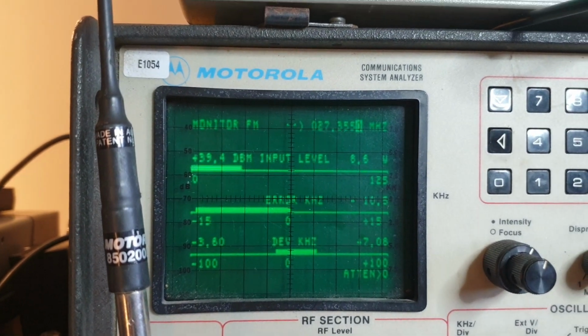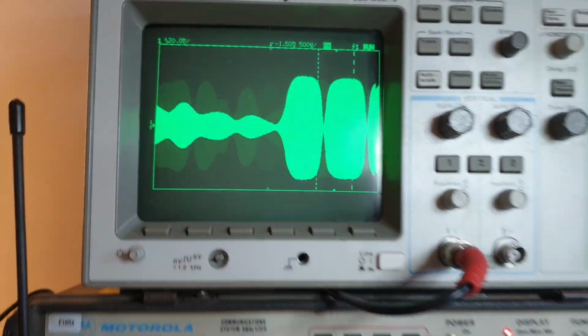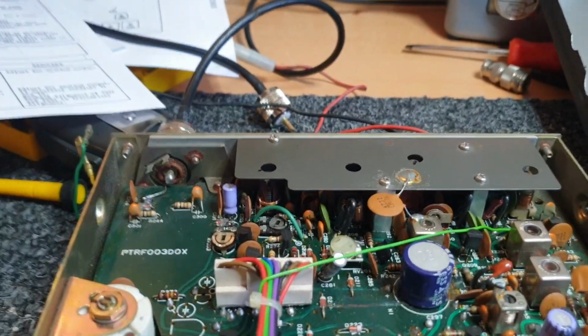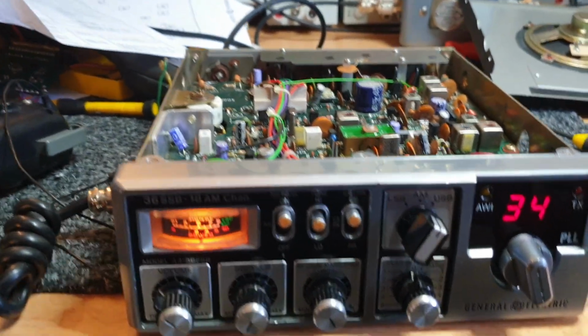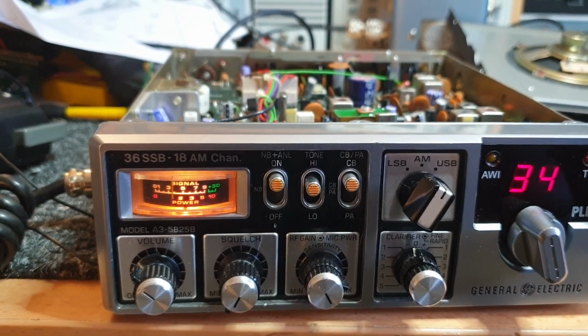Oh yeah, the old 12 watts. So 12 watts is nice and legal. Just flat topping a little bit there, but you can adjust that. RV2 back a little bit if you need to. I like to set them up right on 12 watts. I know that these can do more, but certainly keeps them nice and legal.